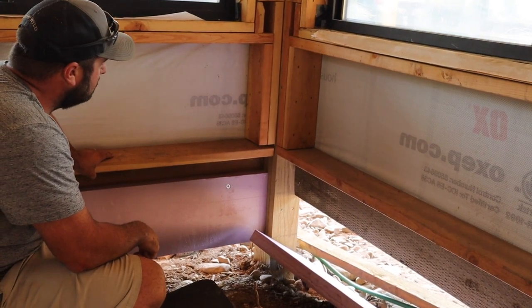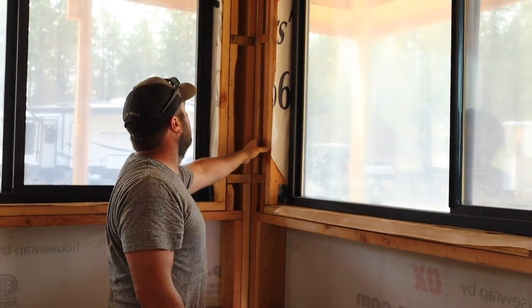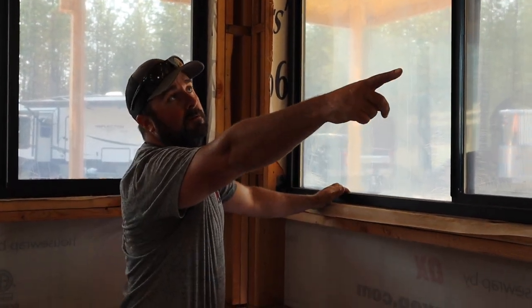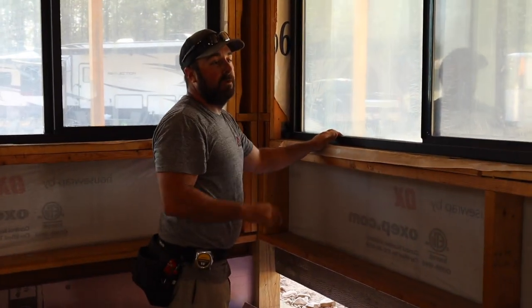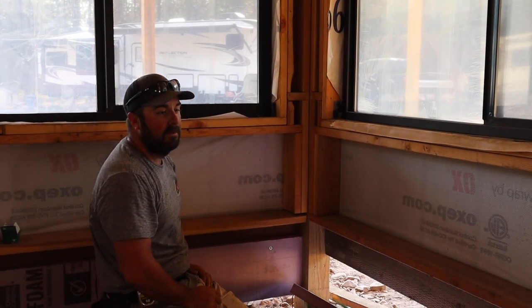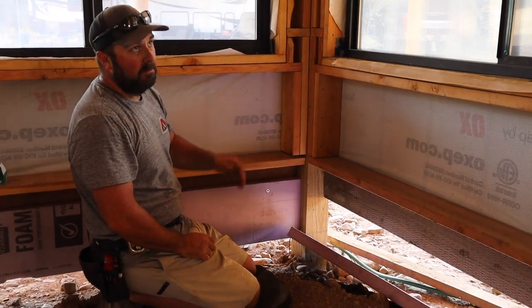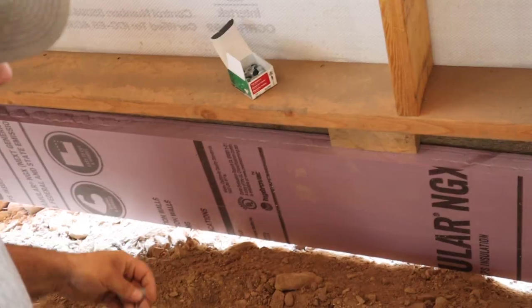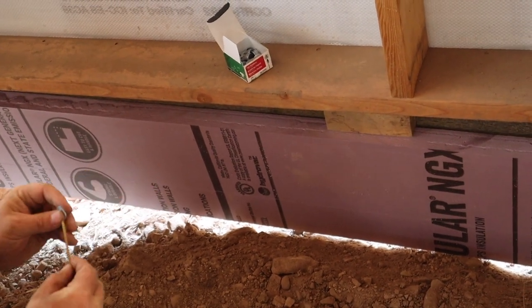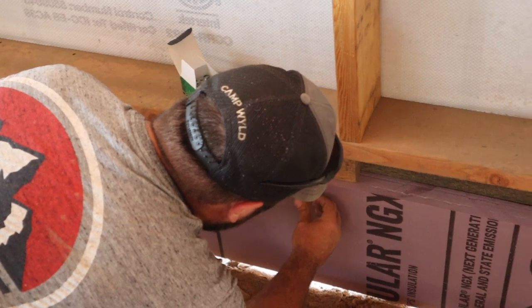I think we're good where we're at. I wish we would have done these differently, because there's so much wood right here we're not going to get any insulation — there's 12, 10, or 2x4s — and there's not very much R-value per inch of wood. R-value is what they measure insulation by; I think it's resistance to air movement — that's how they measure the insulation value or thickness. So we're just bringing the rigid foam to the top of the slab, and then there'll be more foam underneath the slab that this will tie into.